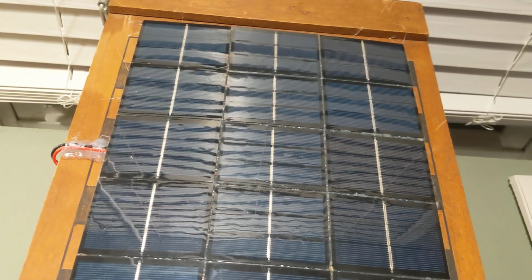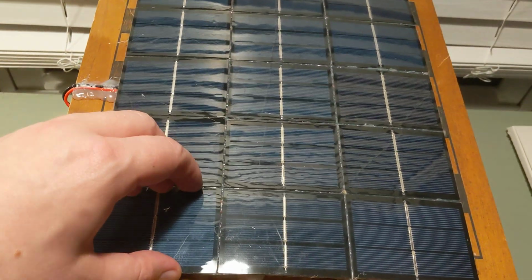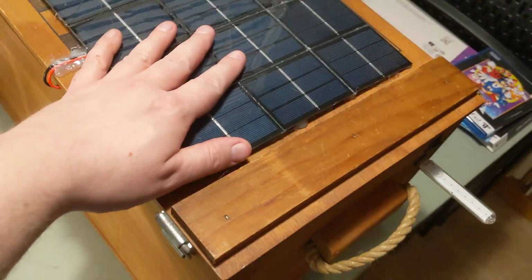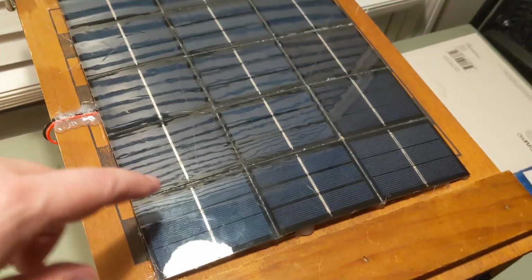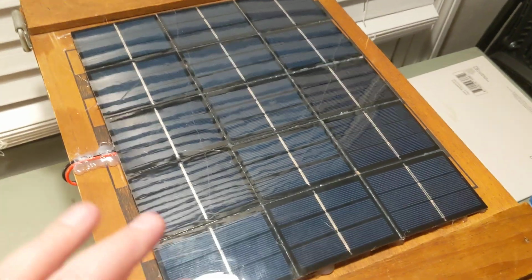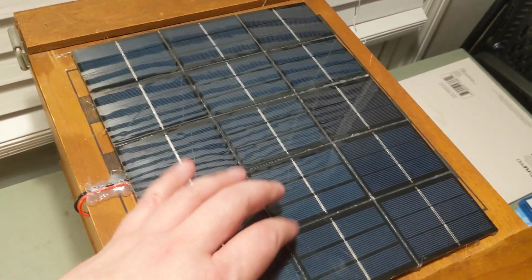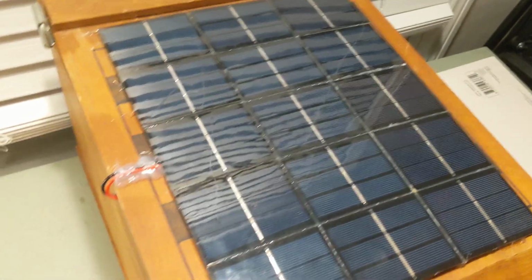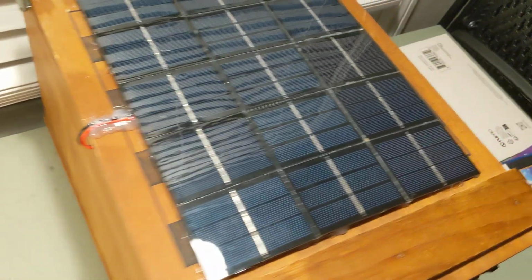positive side before they're wired in parallel, right? So that drops from 1.5 volts to 1.2 volts approximately. So in sunlight, these can get up higher than their rated 1.5 volts. But with a Schottky diode on there, they will get up to, at a maximum, 2.2 volts, I think, if there's full sun. So you got to be careful, even if they say they're 1.5, they do go up. It's not exact.